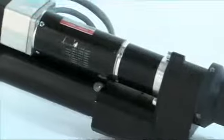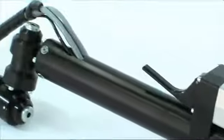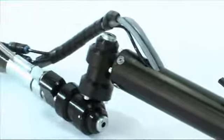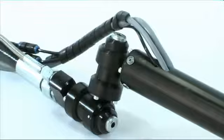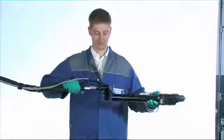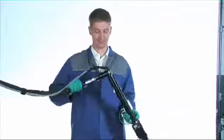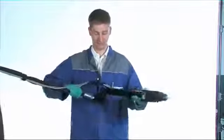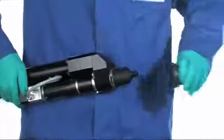The first highlight of this new innovative Dynamic Mixer is the two-component swivel joint. Both material components can run unmixed through the swivel joint, with the result that material curing processes can no longer occur here. From now on, labor-intensive cleaning processes belong to the past. And, thanks to the clever construction of the two-component swivel joint, the maneuverability for the operator is maintained without any restraint.